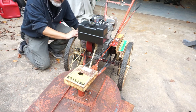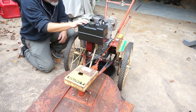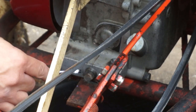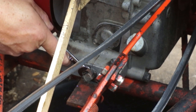As we discussed in our last video, this is a replacement — the DR trimmer is the original from the mid-80s but the motor has been replaced with a Briggs & Stratton 8 horsepower. The manufacturer states this takes SAE 30 weight oil if it's 40 degrees or above, and if it's lower than that it takes 10W-30.